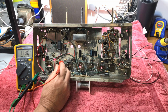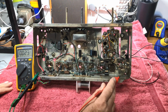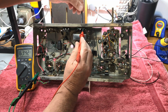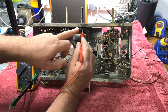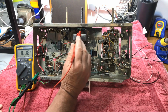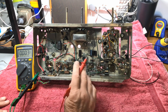We have other voltages here, but of course everything's unloaded. No valves in there at the moment. So our HT all looks correct. We can put the switch over further, and that just enables these wires here, which is 6.3. If I take that off in the middle, voltage there, 6.3, to each of the dial lights either side. And, of course, if you're running off a battery, it's a little bit tricky to have the dial lights running for no obvious reason, so just using battery.